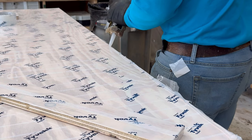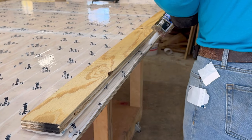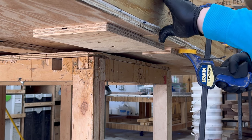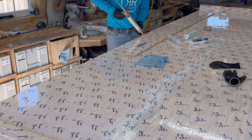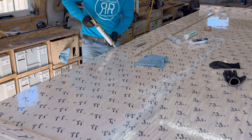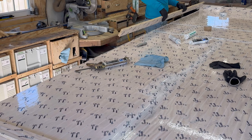After making the bottom of the form I secure the sides with some silicone caulk and some finish nails. I used to do this with screws, which worked fine, except the plies on the plywood would split every time I put a screw in and it would distort the edges of the table.